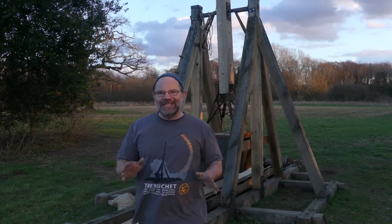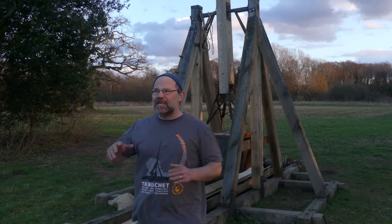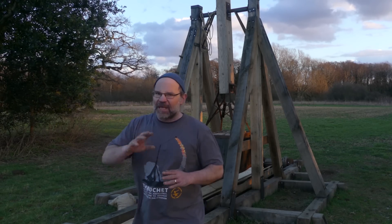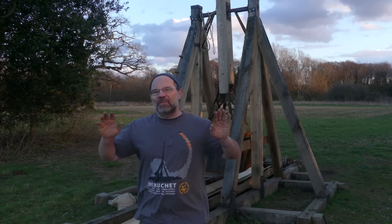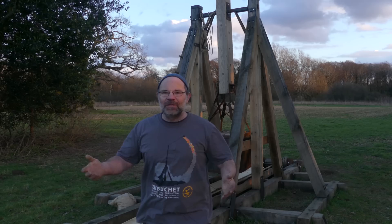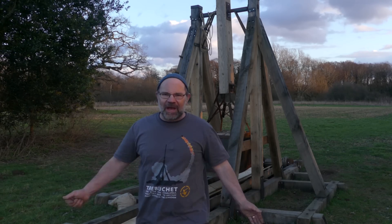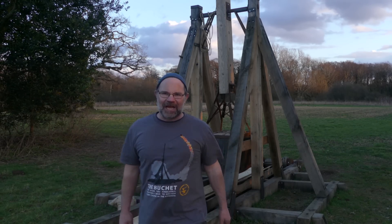Back for the traditional conclusion. I only did two shots today, but the trebuchet held on to the second one for too long as well — it didn't release until about 50-55 degrees, so the shot could go further than it did. Just got to bend the pin back a bit more — all the things about trebuchets. It didn't go very far, about 120-130 meters, so about what it was doing before, but now the basket is calmer, everything is better, energy transfer is better. The potential of the machine is better and it's going to stay in one piece — that's all I could ever ask for. I'm going to be back next time to retune it, have a chat with Daniel over in the States — I think probably the sling needs to be a bit shorter — and we're going to come back for more. I'm still learning every time I touch this machine, but hopefully that'll be the end of the fixing now.